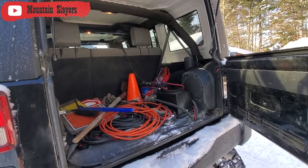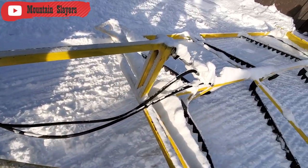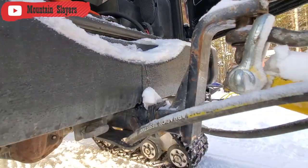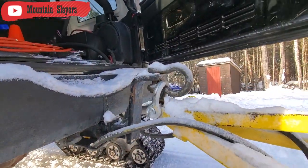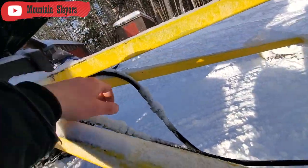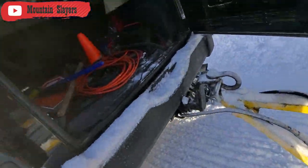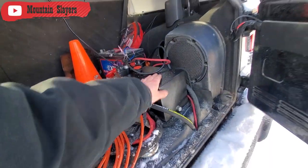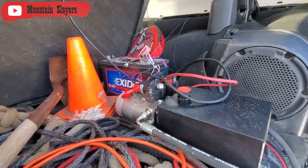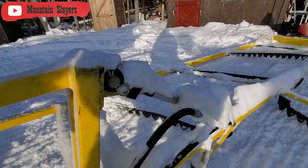When you come to the back, first thing you'll notice is the lift system. All hydraulic assists, all custom design, and all very, very simple. Just got your quick disconnects here, and you got your ram there. Here's our high-flow hydraulics box, complete with a reservoir kit — everything all in one. Even the valving controls, we just got that off Amazon. And a pretty standard hydraulic piston.